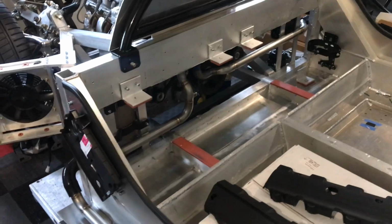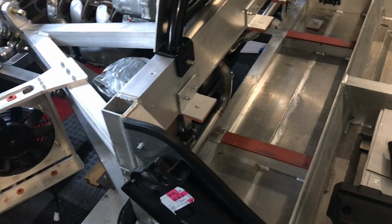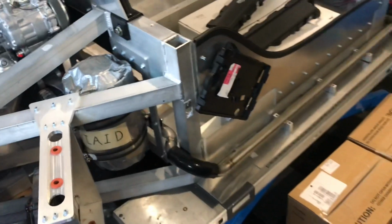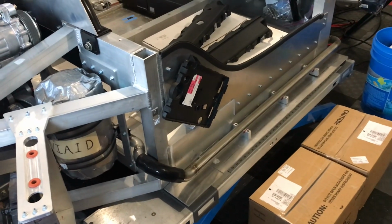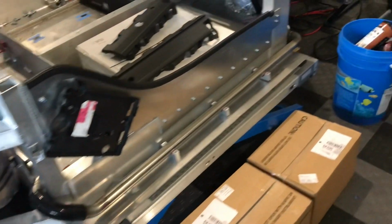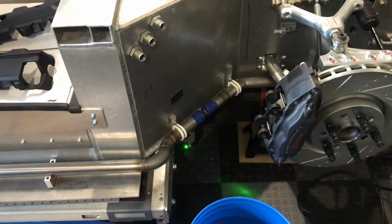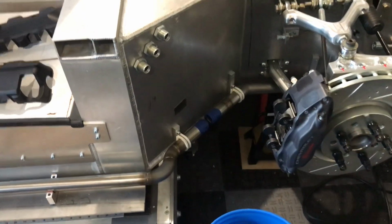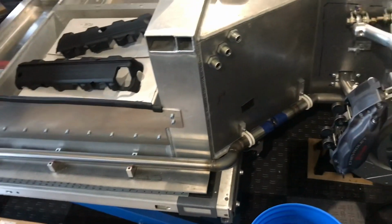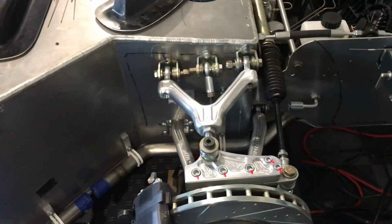But anyway, the water comes down, and these pipes sort of tuck in against the closeout panel near the fuel tank. It gives me access to the belt, so if I need to change the serpentine belts, I don't need to move them out of the way. Then I've got that silicone hose, and it travels through the body and then out the front, and then I'll have a joiner, right around there. So, in this design, I can get these side tubes out if I need to, and then the front and the rear tubes are removable just in case I need to change the design.